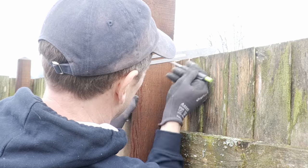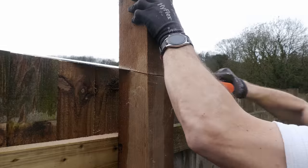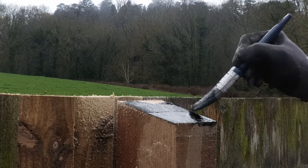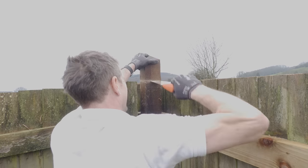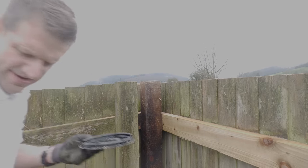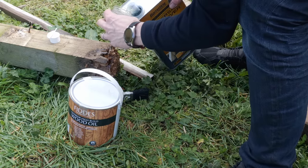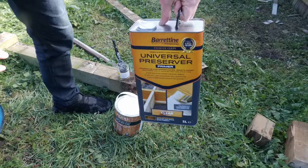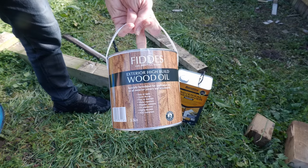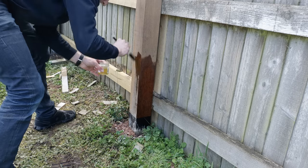The penultimate job was to cut the post off at an angle, which I did mostly using my circular saw. Then a coat of the bitumen paint — well, I had it open so it seemed to make sense. The corner post was a bit more tricky but I managed to get an angle of sorts on it by cutting it by hand with my jack universal saw. And it's raining again. One final job was to treat those two new posts as they've been in the garage for decades and I don't know how well tanalized they are, if at all. So the primer is courtesy of Woodfinishes Direct — they haven't paid me for that reference. For the top coat I'm using Fitter's exterior build wood oil. Overkill probably, but I love being in an overkill situation.